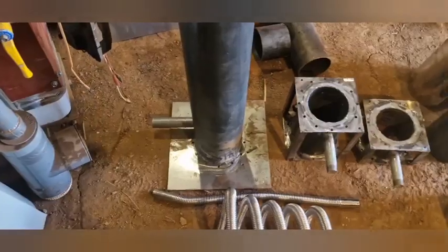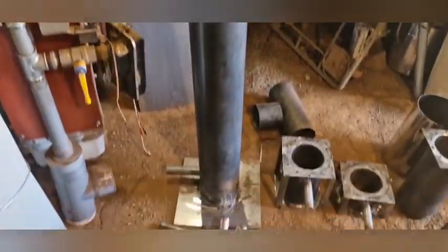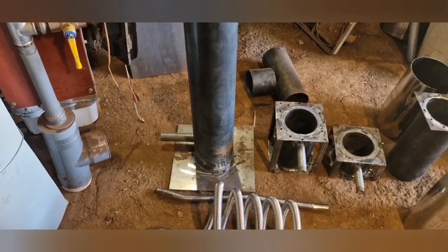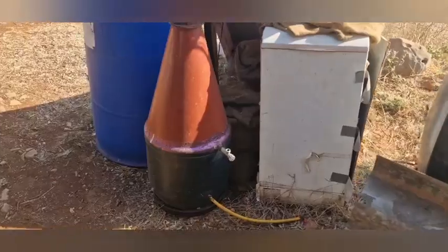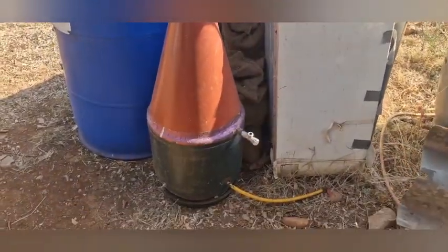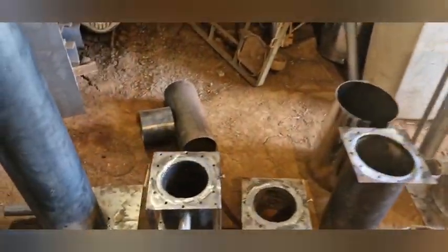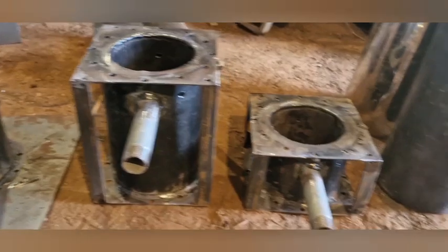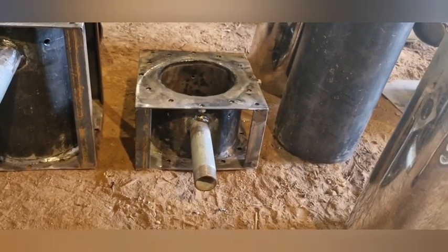Back to the new Lego gasifier — this longer section could be used for producer gas preheating or fuel drying, but I intend to use it primarily for exhaust recuperation. The whole thing is 1 meter 30. The hopper over there — currently upside down — is about 900 millimeters. The lower part is 500 millimeters, the first stage is 200 millimeters, and the second stage is 100 millimeters.